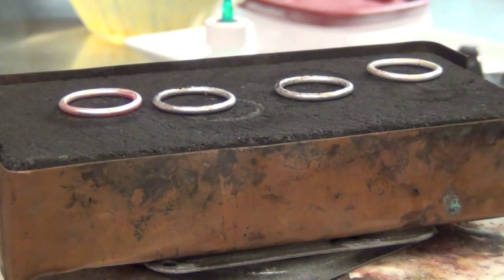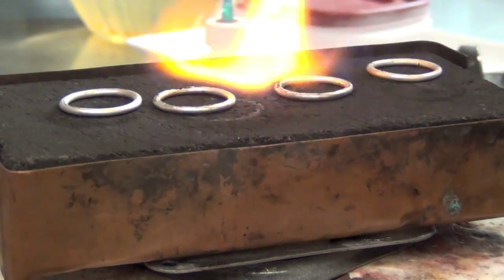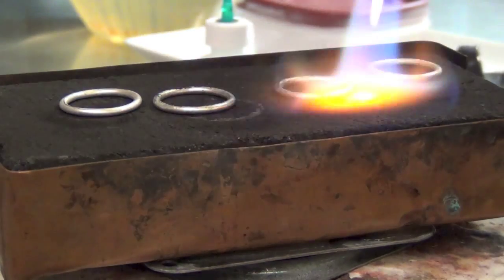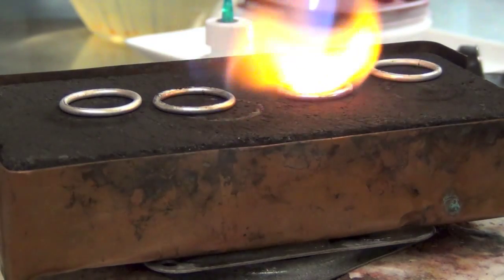If I want to go all the way through this wire, it's going to start to melt. So I go halfway, and I fuse the top, and I see it flow, and then I let it cool, and I turn it over, and I fuse from the back side. Because then I'm not melting it to the core. The round will become ovaled and flatter on the back side if I melt all the way through. I don't want to do that. It's a fine line there. And the seam will disappear. Pretty much. You can kind of still see it, but even just the slightest Scotch-Brite.